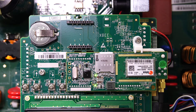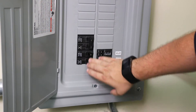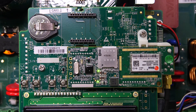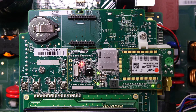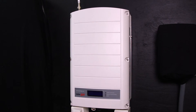Now we're going to verify that the modem has power. Turn on the AC breaker. The inverter now has AC power, and we can verify the card is working properly. All of the LEDs should be lit — the power LED is here and it should be green. Secure the cover back onto the inverter.